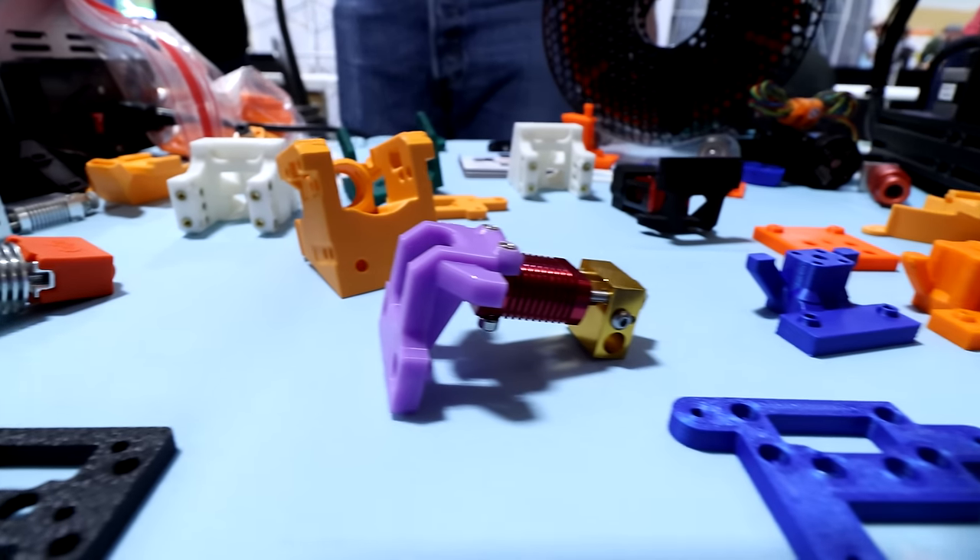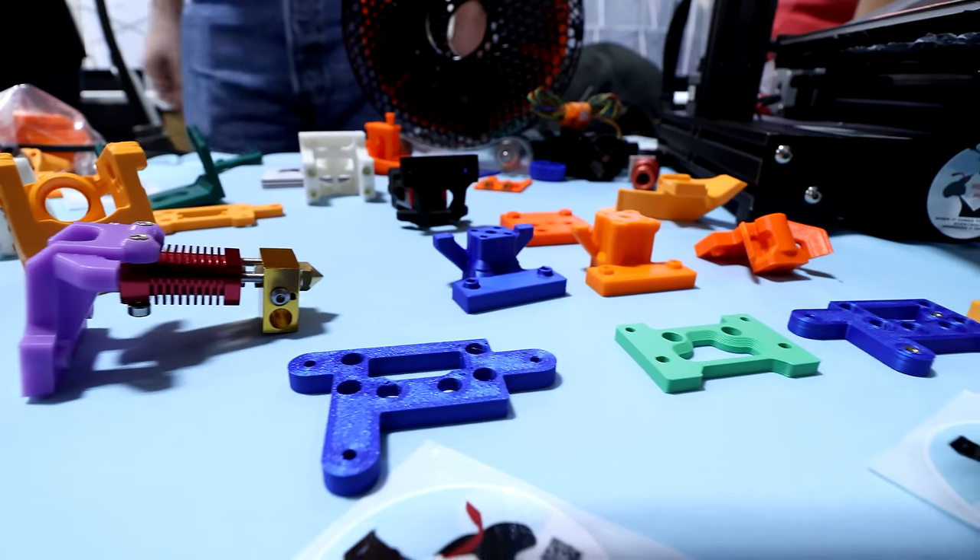Over the last 4 or 5 years, I've spent time researching printers, researching gantry adapters, researching hot ends and extruders, and making all of the component parts in a way that you can mix and match any way you want, and it'll all just work. It's symmetrical, so you can go left or right with the ABL sensors or out front. Everybody who's upgrading has their own preference of an extruder or a hot end — I've got a system that allows them to put them together without having to find somebody with that exact combination.